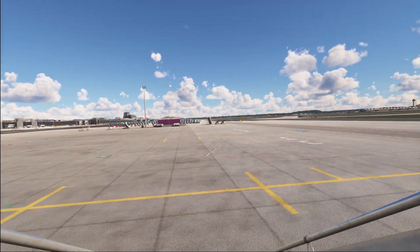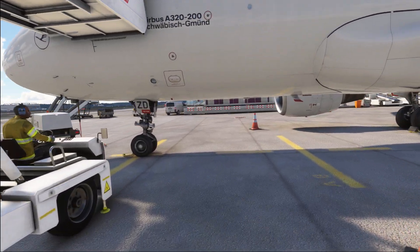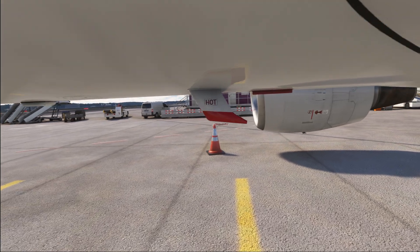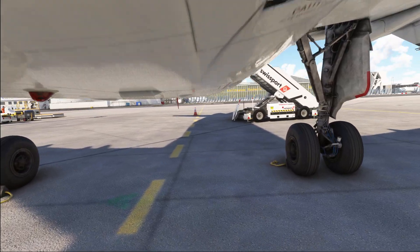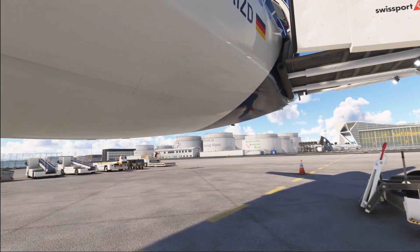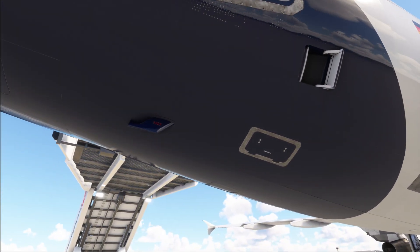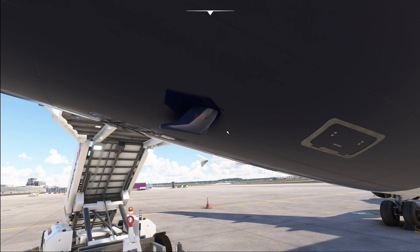If we go down the ladder you will find those rather quickly. I'm going to introduce you to two of them — the drain masts. You can see one in the front, and you can tell it's a water drain mast because of the HOT label on it. There is a second one located in the back of the aircraft. The reason for the HOT label is that you're flying at minus 56 degrees in cruise, so you definitely don't want that water to freeze on your aircraft. The second mast is located just over here, so that's where the waste water comes out.